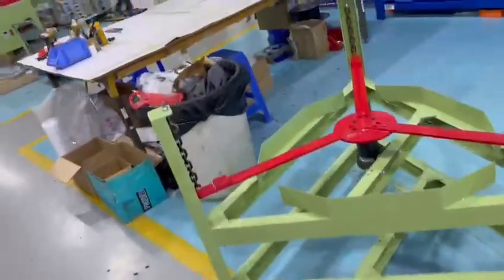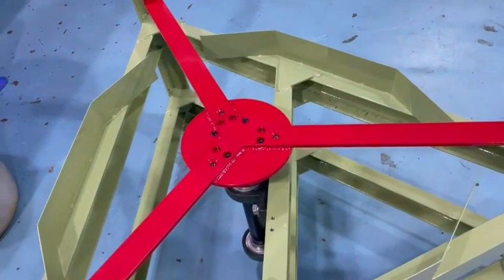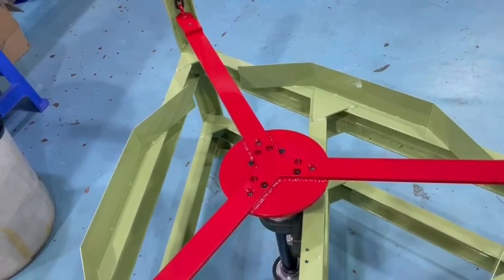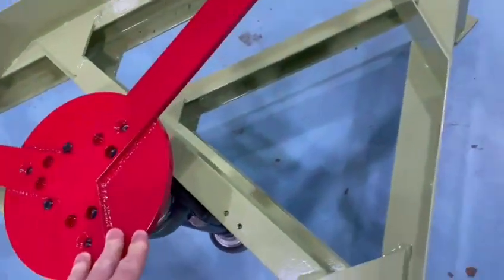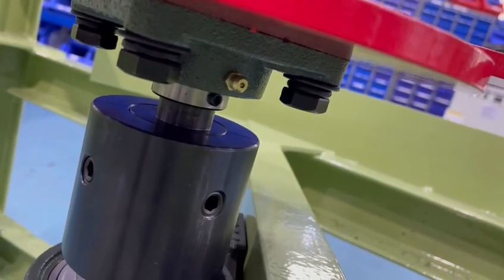What's amazing about this machine — this plate's got a huge amount of mass, and the counterweight's throw is only about three-sixteenths of an inch. It's a very small throw, but that movement is just enough to create a really good reciprocal action on the slabs that are running in it. But if that plate starts shifting because something comes loose, then that vibration will be very destructive — it's like the difference between running smoothly and something like a jackhammer. Usually the first casualty is the top bearing underneath there. So if you wipe out a top bearing, almost always it's because something was loose and vibration was occurring.